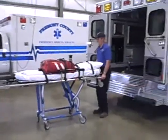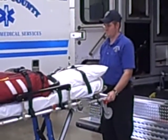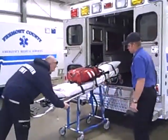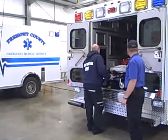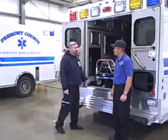To go back in the ambulance, you need to put it into the load position, then lift and assist it with two people going back in. We didn't demonstrate that in this video because we didn't have any weight on it, but it would be a good idea to make sure that you assist it. First and foremost, once it's loaded in, make sure you put that tail in the upright position — otherwise we could have damage.